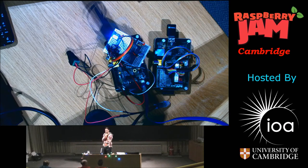There are also boards out there like the Makey Makey, which takes physical computing to a more personal level — using everyday objects as keys. All you have to do is plug the Makey Makey in via USB with no driver problems, then plug alligator clips into objects that conduct electricity to complete a circuit. You could be holding one end and have the other end plugged into a banana, and every time you press the banana it completes the circuit — so you can make a game controlled with bananas.